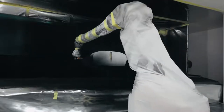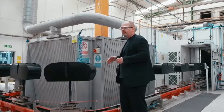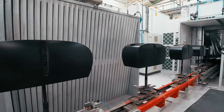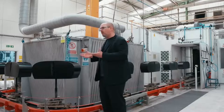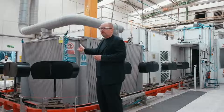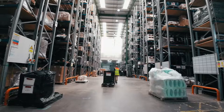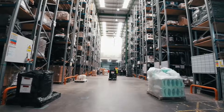Our paint process is applied by robot. We have an automated paint spray robot moving products through the paint process and then through a stoving oven, which bakes them before they receive more coats. The paint robot applies four coats in the first instance, then we flatten them back to remove any surface imperfections, and they come back in to receive a further four layers — so eight coats of paint in total on this black model. After leaving here, the cabinets sit in our warehouse for two weeks to allow the paint to fully cure and become really hard, only then can we machine polish them.